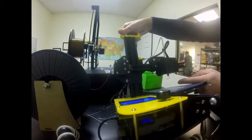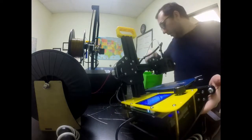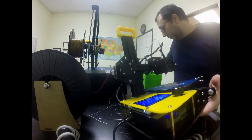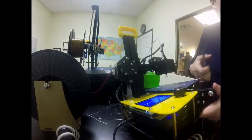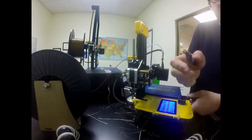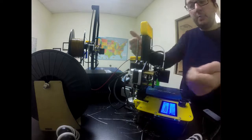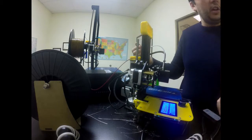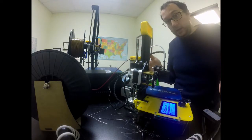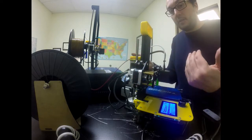You'll see filament coming out of the end of the nozzle. We don't want to grab in there with our hands because the nozzle itself is hot, so we use our tools — clippers or pliers — to reach in and grab this. The color coming out is still blue, which was the old filament, so I need to push more to actually clear that out. Pushing more new filament through is also how we make sure the new filament is all the way in.